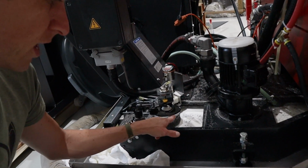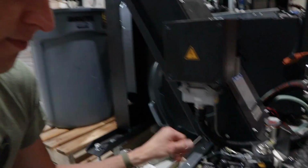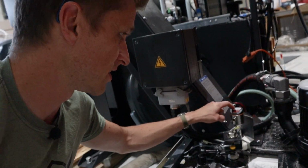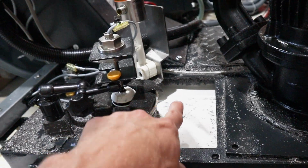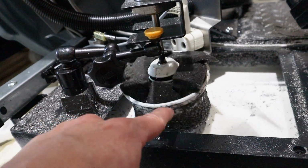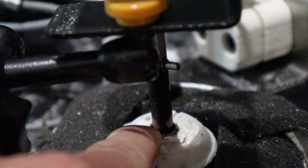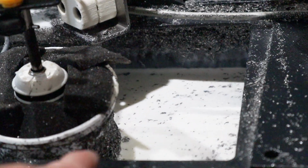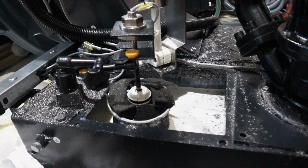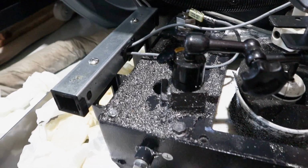But yeah, and then also if you've been a long-time watcher, you'll remember the yogurt tub float container. This float, when it goes up, it turns the pump on, pumps everything out. And honestly, the yogurt tub is still holding up strong. I have these IFM sensors, I've tried all kinds of stuff. Nothing works as reliably as this yogurt tub. And it's because of the chips floating in the coolant. You can see them sticking to the outside of the yogurt tub, but that doesn't affect performance. It just keeps this shaft, because this shaft used to get plugged with chips, so it would stick. But now it's keeping the business end away from the coolant, and the coolant's just riding on the bucket. So it works awesome. And you can see a lot of the chips have accumulated up here as it's foamed up or overfilled, mostly due to foaming.